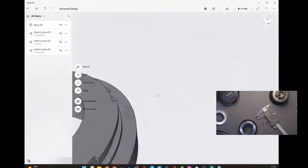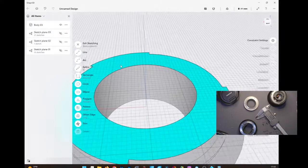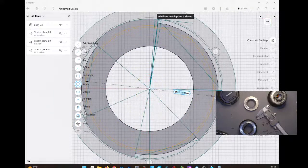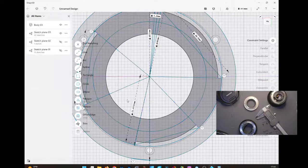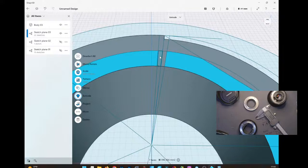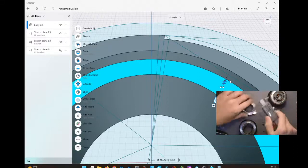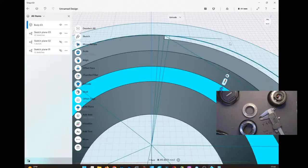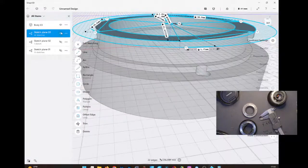So, our rough lens mount, changing this Micro Four Thirds on the Samyang 12mm over to Sony E, is almost done. What I like to do is I'll typically offset this center part here. 18 was my regular radius, so 36. What I will do now is simply select these guys. Oh man, should have trimmed those. And just inset that. I guess we could just use this as our gauge, like 4mm. Doesn't really matter. Just enough to give you the room to pass the contacts on the camera.